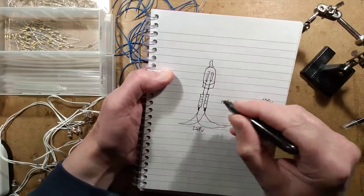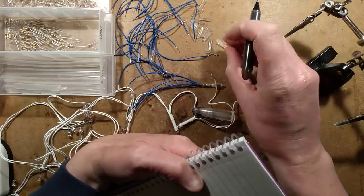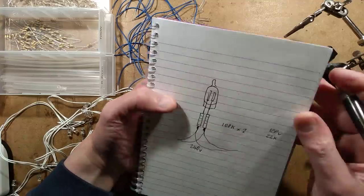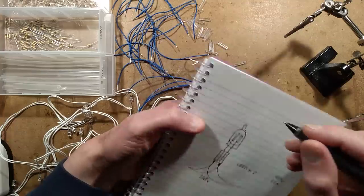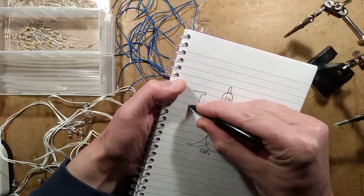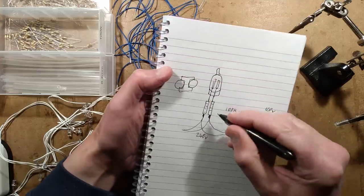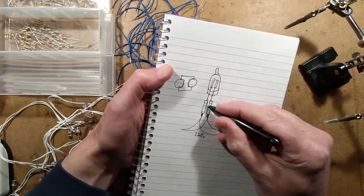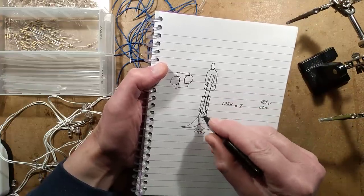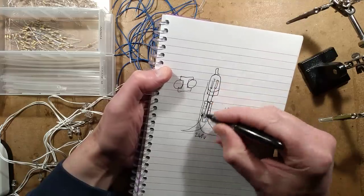To keep these apart, I'm going to use these little plastic spacers out of a set of bog-standard LED Christmas lights. They're used because they're quite easy to use in the manufacturing process - it looks like a little H-beam. I'm going to set the resistors and wires in either side and bring them down so those spacers extend down to the mains wire, because we don't want those wires shorting together. Then I'm going to put the whole lot under heat shrink.